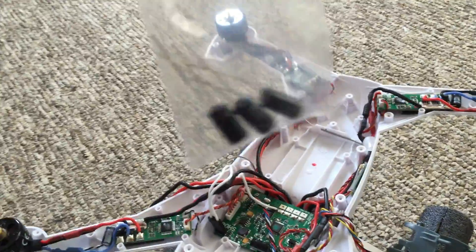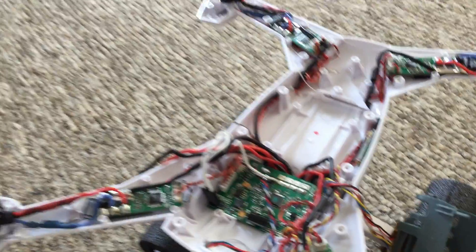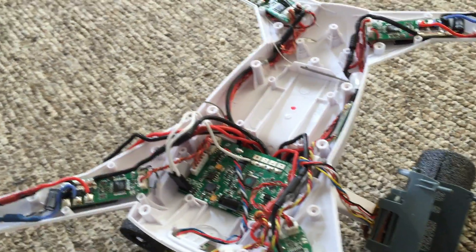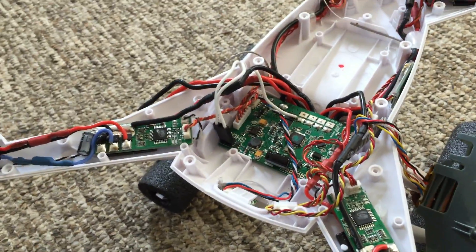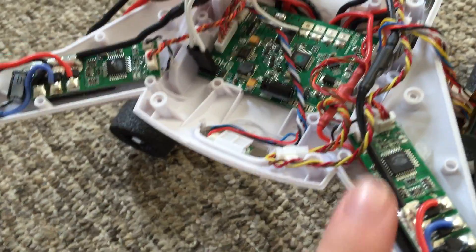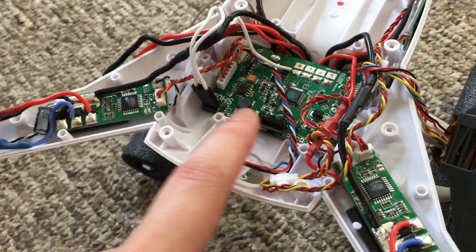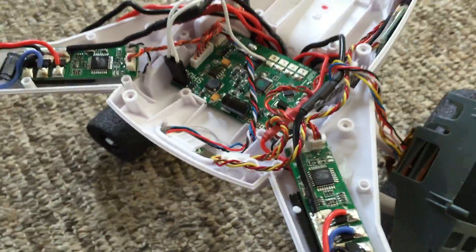Cheap — $3.00. You can buy them off eBay: Chang 100UF 35V capacitors. A link will be in the description below. I believe Horizon is fitting a 10V 100UF on the AP versions, so this 35V is actually better than what they've included.